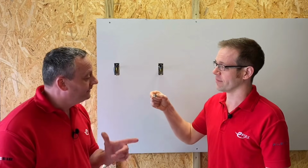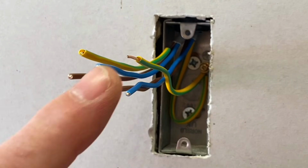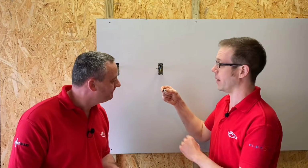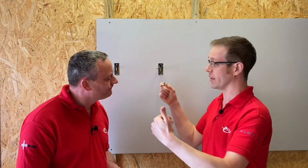And the white connector you described had 2 holes. So we've got here 2 switching line, 2 neutral, 2 CPC. So ideally suited to take the feed in and then the feed out in that side of the connector. Absolutely, and the output side at this position would again go out with the flexible stranded conductor to your light fitting.